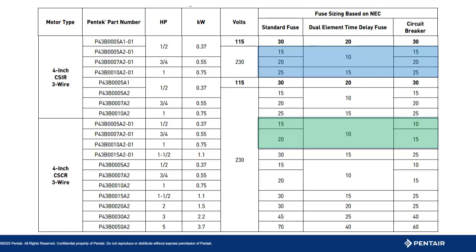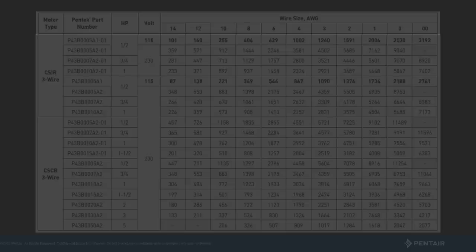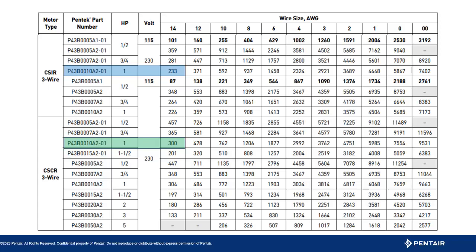The capacitor run box also impacts fuse sizing. Looking at the circuit breaker sizing, a one horsepower pump needs only a 15 amp breaker versus a 25 amp breaker if using an induction run control box. If it can impact the breaker size, what about wire sizing? The motors are identical, so the difference again is the control box. As an example, if the complete wire run to the pump was 275 feet and you were using the induction run box, you would have to jump to 12 gauge wire, and your savings on the control box could be lost to the cost of the heavier gauge wire. Yes, the type of control box does impact the size and run of wire.